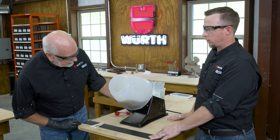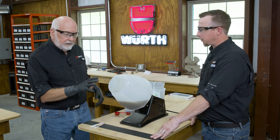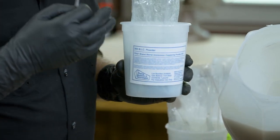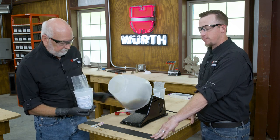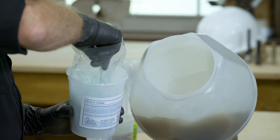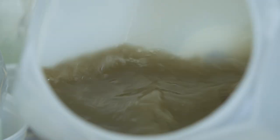Something unique about this process is that you can start and stop it — I don't know of another process you can do that with. Our next step after the promoter is a special proprietary copper powder. You have to do a copper flash that promotes adhesion. We're going to put this in and start it again. It doesn't take much — upwards of about five minutes. What you're going to see is these screws start to turn a copper color — a copper flash coating.